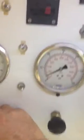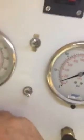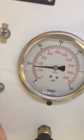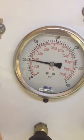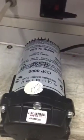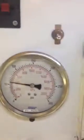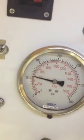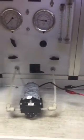So let's say your system had 50 psi back pressure. With a 60 psi bypass setting, when you hit 50 psi or just past 50 psi, you have bypass engagement noise. If we had the bypass set to 80 psi, you would not. You want to set it to 80?